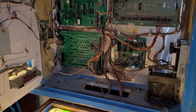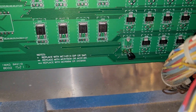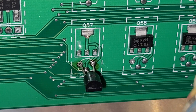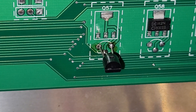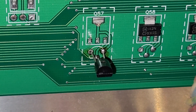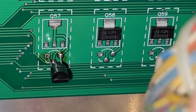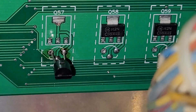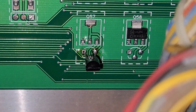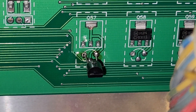Here is the finished handiwork — check this out. You can see Q57, I clipped it off and then installed the 2N5060 right below it. I wasn't sure about orientation — cathode, anode — so I started looking it up. But I also zoomed in on the board and if you look closely you can actually see the shape of the transistor right where the three holes are. It's telling you that's the way it's supposed to be oriented with the arch up.